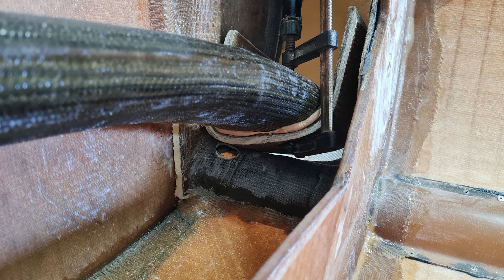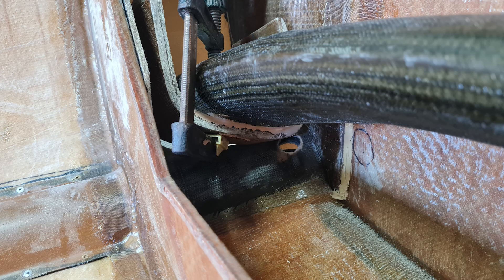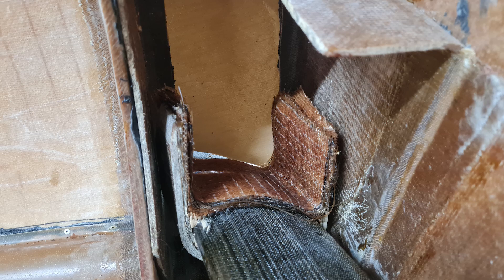There's a few ways we did this, but we start by using this putty stuff which we call micro glass, to fill in the gaps around the gear leg and gear pockets. The putty is just a mixture of micro and epoxy. The next layups were 10 layers of triax on top of the gear legs.